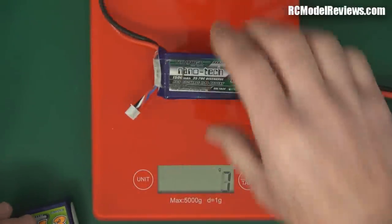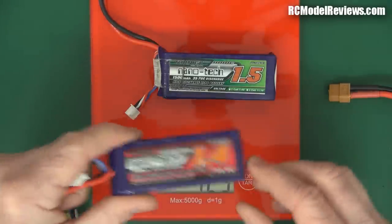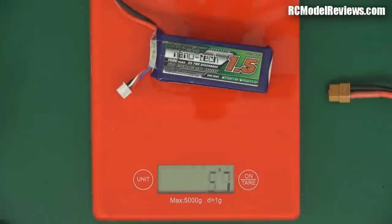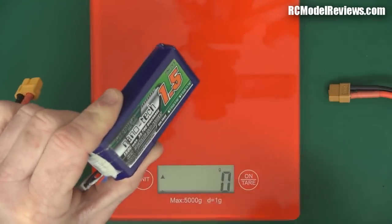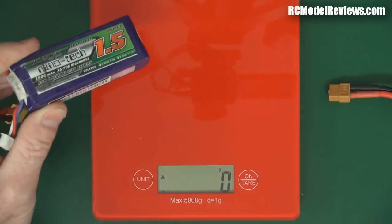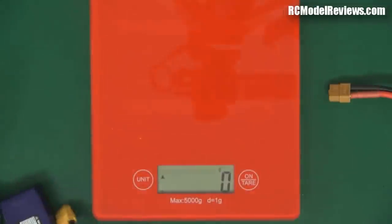Moving up then to the 1.5, and that weighs 129 grams - so it's heavier. It's an extra 100 milliamps over this one. We're talking 118 to 129, so 11 grams heavier. It doesn't sound like much, but honestly in a mini-quad, when you're really hammering it, you'll really feel the difference with this battery. Remember also, this battery can't even put out as much current as this one or this one. So if you're really hammering it, if you want to go racing, you want maximum punch-out, then this battery is just going to outperform either of these two.